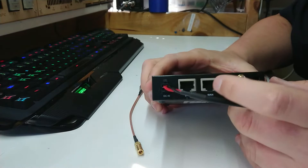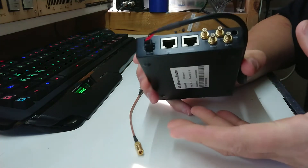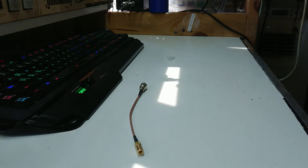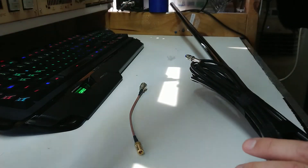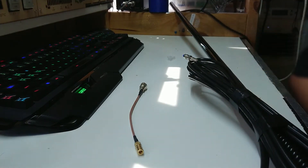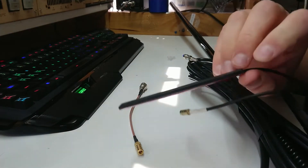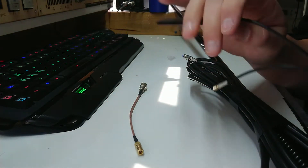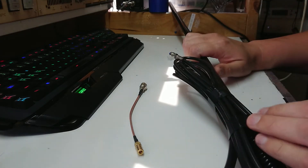The new one has two more SMB connectors to handle 5 gigahertz Wi-Fi — not fifth generation mobile network, which is something like 80 gigahertz. We want to connect the MIMO — multiple in, multiple out. I currently have one of the factory supplied antennas. Out of the box they come with these 4G antennas, a little element in a little package, but as soon as you stick them onto something metal the SWR goes way out the window and becomes completely useless.